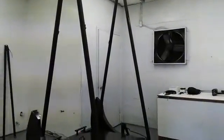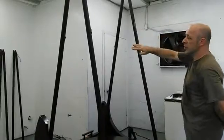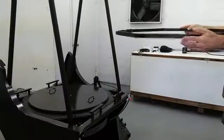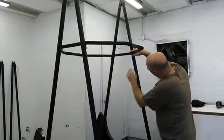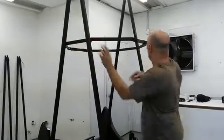We now have the pins on the inside of the trusses — these are for the truss spreader to lock into. There's ten inches of protective material here to stop the truss from getting scratched when you install the truss spreader, so make sure you stay in this area. The truss spreader will have the word 'Argo' marked on one side, which obviously goes to the Argo side of the scope. Hold it up, approach from the back of the telescope — it's easier. The holes in the bottom of the truss spreader will line up with those pins. Make sure it's lined up on both sides, then tighten it down until it locks them in place.